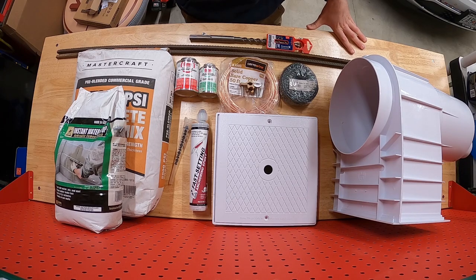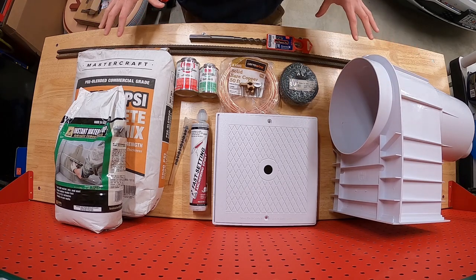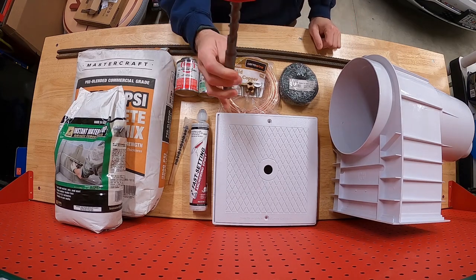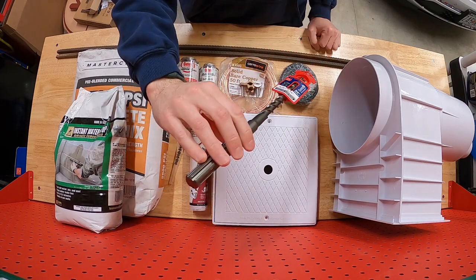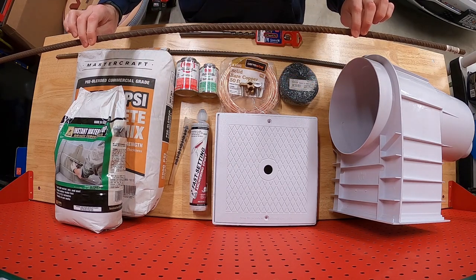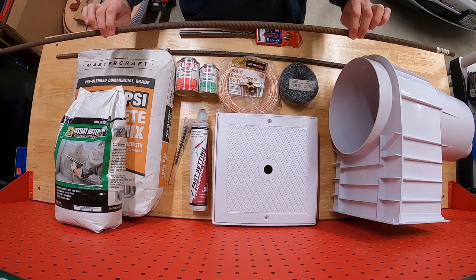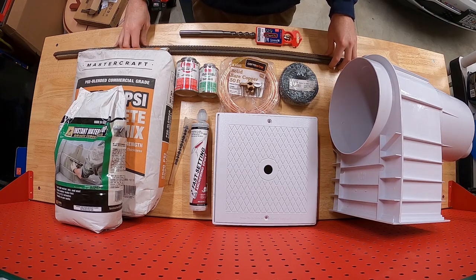Let me walk through the products and approach we're taking. First, we've got the new Hayward Skim Master with the square top lid — I was really excited about that because we're putting in a travertine pool deck and the square lid is going to look nice. We're installing two of them. The basic idea is: the old skimmers are removed, so there's a big hole in the pool, and we need to set the new skimmer into the throat and bond it structurally to the pool shell. To do that, we have a rotary hammer drill and a 5/8-inch concrete and rebar SDS Max bit.